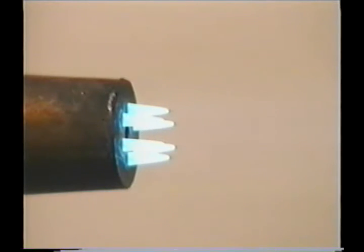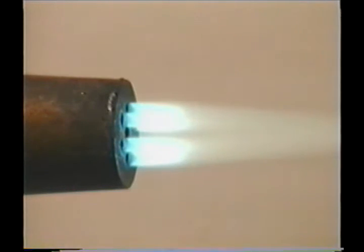If you don't add enough oxygen, the preheat flames won't sharpen up. This is called a reducing flame and there's an excess of acetylene that will slow down the cut and mess up the oxygen cutting jet.